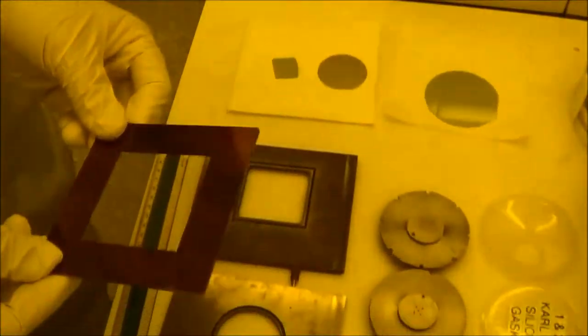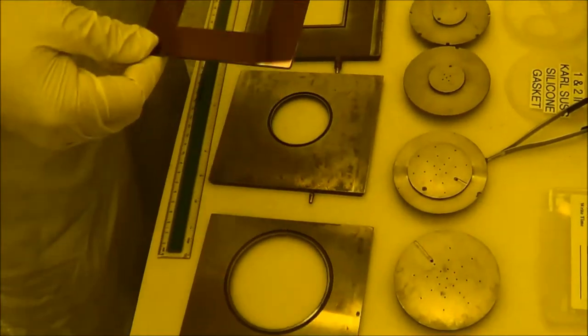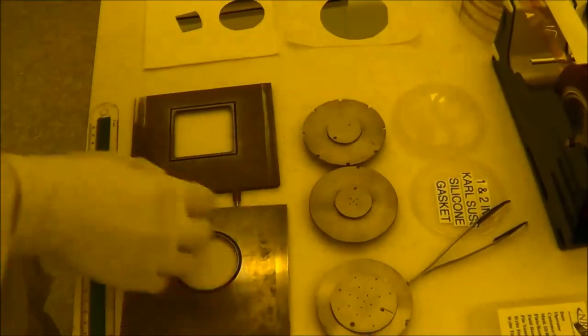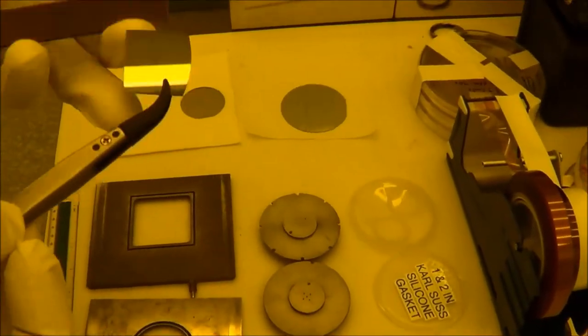I have a 4-inch mask here, so you can see this side is the clear side. I mean, this side is the quartz side. This side is the chromium side, so a lot of metal is deposited on this side. So normally, when you do exposure, the chromium side or iron oxide side should contact your sample surface. If this is your sample, with the photoresist after spin on there, it should go like this.